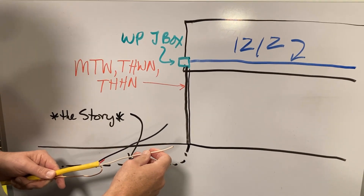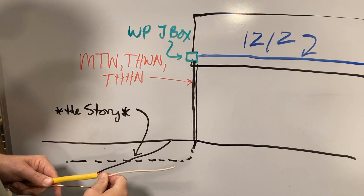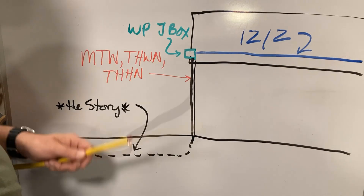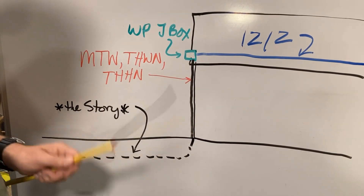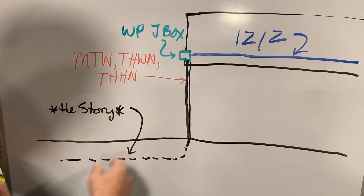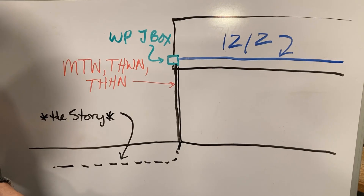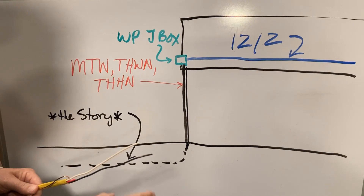Why did that happen? Fill. Being careless — somebody was trying to stuff too many wires in a small conduit, or too many bends, and they were yanking it and weren't careful with the wire. Or maybe — my personal pet peeve — the wire was coiled up on the cement or the deck before they pulled, and they walked on it. You savages that walk on wire — that's bad, don't walk on wire. One of the reasons is because you're going to damage the sheath, pull it underground, it gets wet, and bada bing — you have burning wires underground. It sounds like snakes on a plane, but it's wires in a pipe, and it's boiling water, and it's bad.